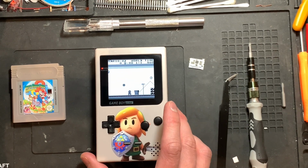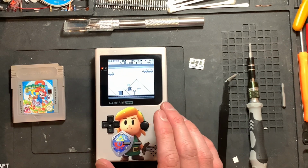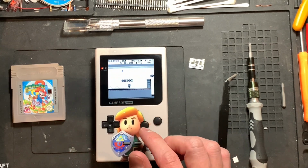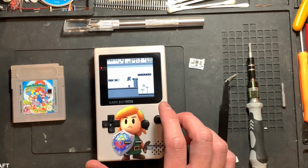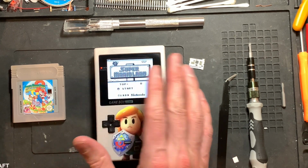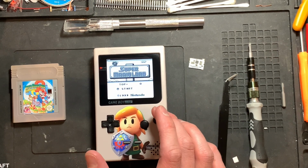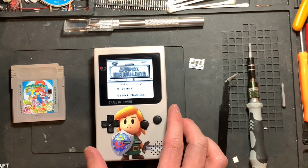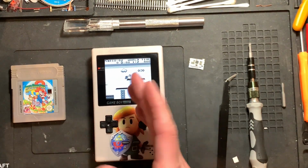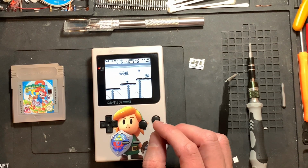I got a comment from a friend who said the reset could very well be due to the voltage regulator inside here, because the IPS screen is actually more power hungry than the previous screen, and or needs a more stable power supply. That makes sense, I guess, because it has backlight and everything, which probably takes more than the previous display did. So what did we do?